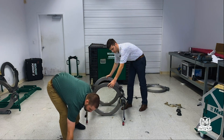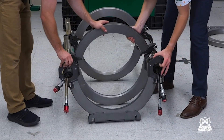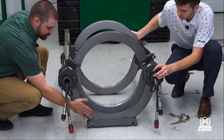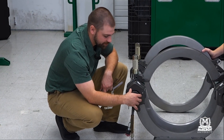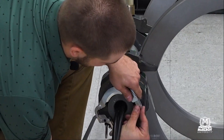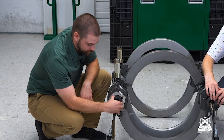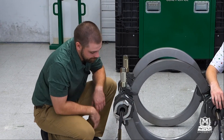I'll grab our fixed jaw support, feed our hoses through it just like so. Same thing as before — we're going to take our clamps and install the jaw with the clamps. You still have to have the jaw nice and square, backed up to these guide rod sleeves, so make sure it's nice and square. Another thing you can do is loosen out these threaded connections a little bit — that's going to give yourself a little more room to install these clamps and make your life a little bit easier. Take our clamp, same thing as before, goes right over the pins and clicks into place. Whenever your clamp is on there, if it's still a little loose, feel free to thread that in and get it nice and snug against that clamp so it's nice and secure.